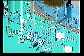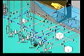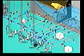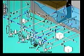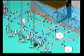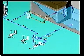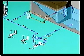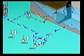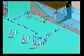Keep an eye on the level of this tank. There is a U-pipe connecting the port slop tank with the starboard slop tank. When this U-pipe is open, the water starts to flow back to the starboard slop tank when the ullage in the port slop tank is less than 10 meters. The oil returning with the dirty water from cargo tank number one flows to the top of the port slop. Relatively clean water now flows from the bottom of the tank back into the starboard slop. This way, the washing water is circulating in a closed system.